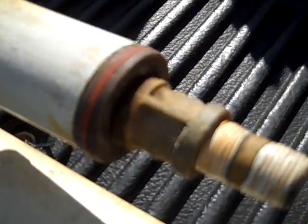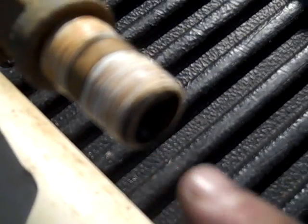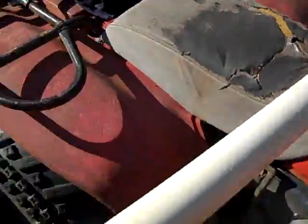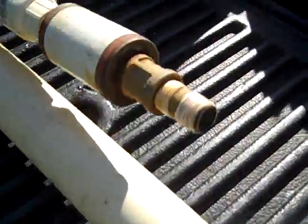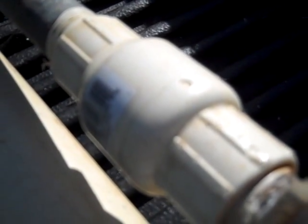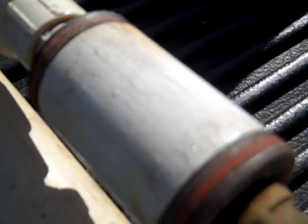This is a force pump. When you push down with the piston, it forces the water to go up the tube. When you pick it back up, it pulls more water in through the foot valve — the homemade foot valve. It sucks water in when you pull up, and when you push down and put your weight into it, you can shoot a stream of water pretty far. I can build 50 PSI with it. I've got a check valve to keep the water up in the handle to the top. I like spreading out the gaskets because it stabilizes the piston in the cylinder.